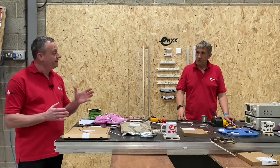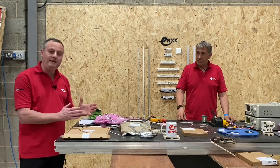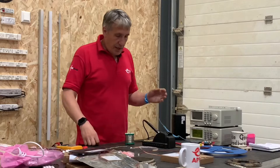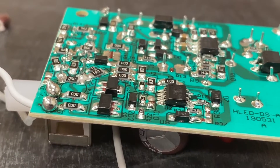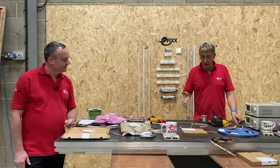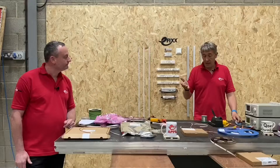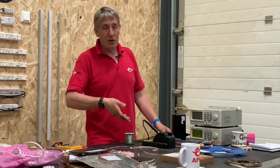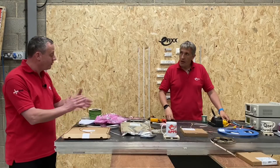I'm a little bit concerned — if it's one of my early soldering attempts, I've got a three-second window to make my connection. Why three seconds? A normal PCB in electronic equipment is made out of fibreglass — pretty hard to damage. But LED tape tends to be built on a plastic-based PCB material, so the longer you're in there, the more chance you have of melting the plastic, pulling the copper tracks off, and basically destroying the LED tape.